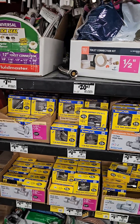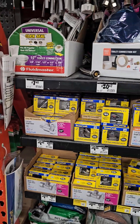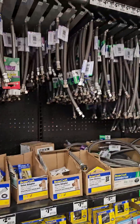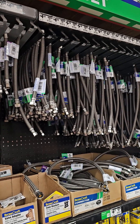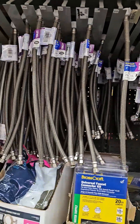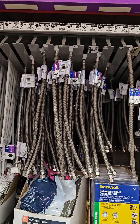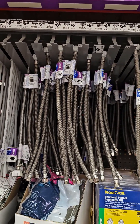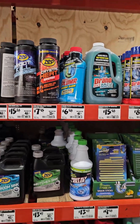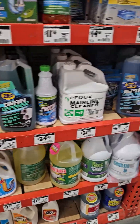There are your cutoff valves. Make sure you pay attention to all that — very important. The ones over there are for your sinks and faucets — don't get those for your toilets. Get the toilet-specific ones. Know the length you need and make sure you measure how far your water line is from your toilet. You don't want to come up short. And again, stay away from that drain cleaner — this stuff should have dust on it because nobody should be using it.